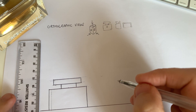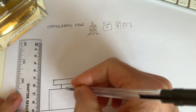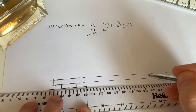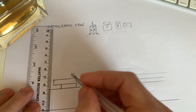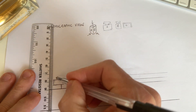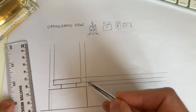Now what we're going to do is use some projection lines across and up to try and draw View B and then View C. So now that View A is drawn, I'm going to take these lines across. These are what we call projection lines — they help draw the other views. Every point you see on the front view, you take the line across, and every point you see here you take the line up. Projection lines — don't worry if they cross over each other.